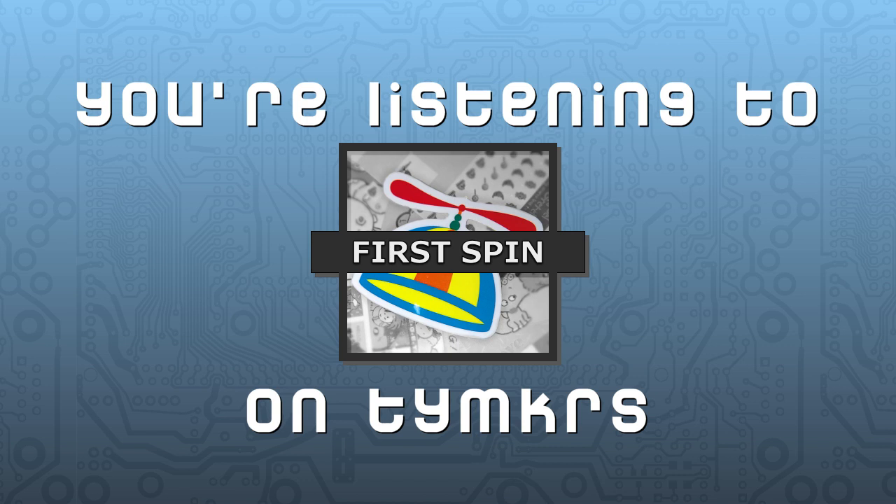It's just a module, like an altimeter or gyroscope. You can also use a supercap instead of a battery, which will hold the time for many days without power. Adafruit and SparkFun both have pre-made modules with the crystal, battery backup, and chip all on board — you hook it up with data lines, run a program once to set the time and date, and from then on you just read it for timestamps or display output.